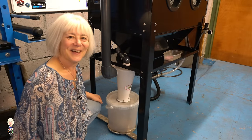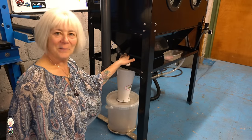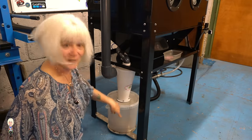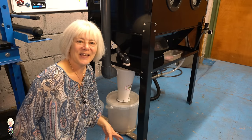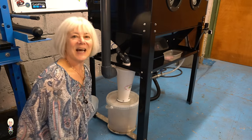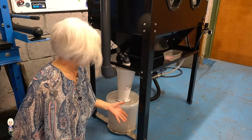They work like this: the vacuum sucks up the middle, that pulls the dust in which gets swirled around and eventually drops to the bottom. My vacuum so far has had almost nothing in it from the few times I've used this tank. I've also made a stand for the bucket to sit on, so it goes wherever the tank goes.